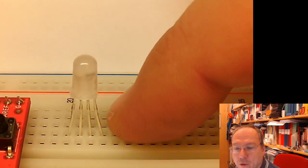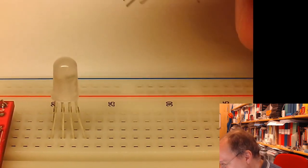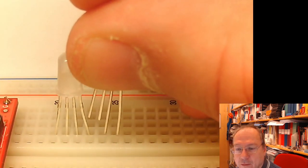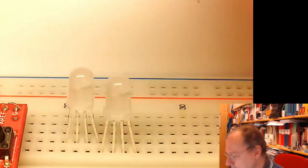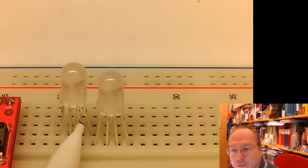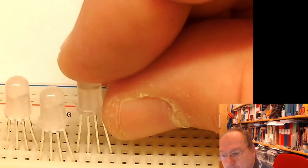And then the rightmost leg of this LED is the D out pin, which should go into the leftmost pin of the next LED. So if I stagger them like this, so that they overlap in one pin, then I don't need another wire to do this. So the leftmost pin of this LED is connected to the rightmost pin of this LED because they are in the same column here. And I find the next LED, and I also do it the same way over here.